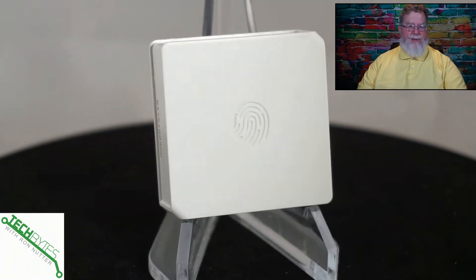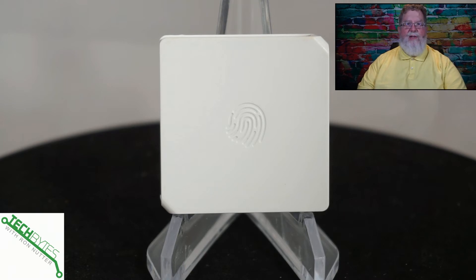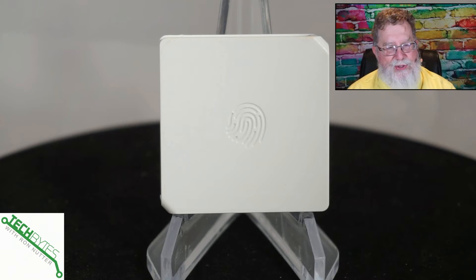The Sonoff Switch is going to be a little bit different. You can see it's got a fingerprint on it, so it very clearly tells you this is a switch. This is the part that may get a little head scratching. Sonoff, I think, is in the middle of an engineering change of some type, because the website listing says it doesn't come with a battery, but the information that comes with the unit says it does. If you don't have a battery, it needs the CR2450 — it's a three-volt button battery. The card inside the box tells you to remove the battery saver paper, but not only is it not battery saver paper, there's not a battery. So at least with the one that I got, the website listing said it didn't come with a battery, yet all the other Sonoff devices that I've gotten did.